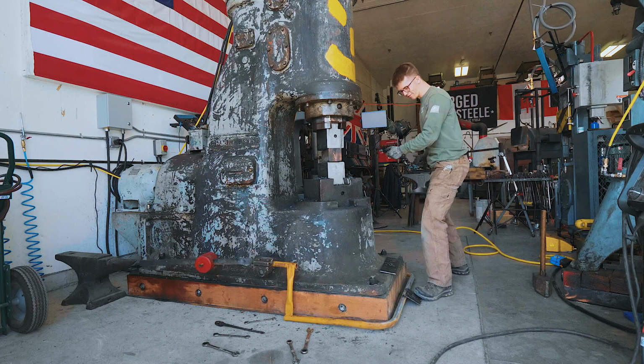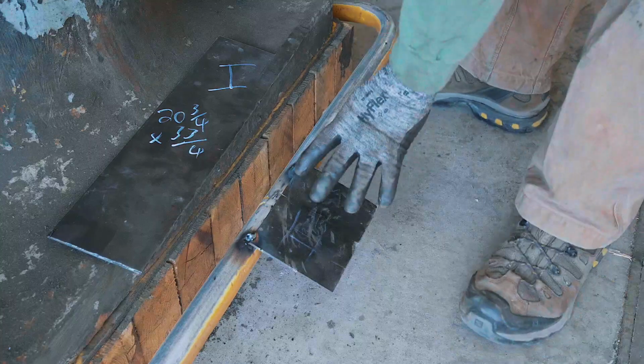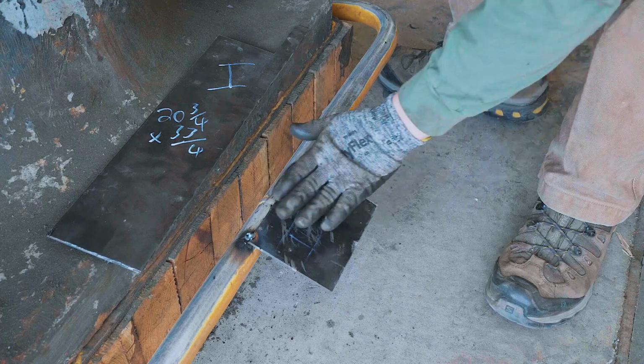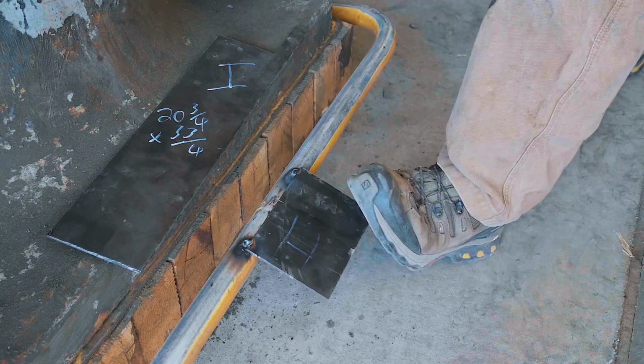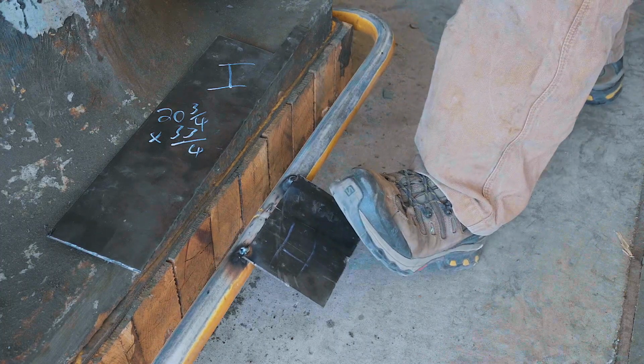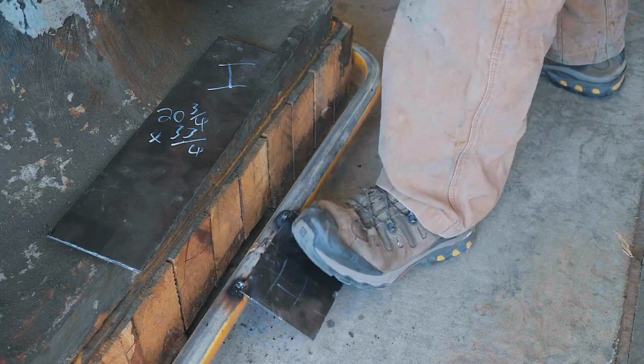That's such an improvement. Tiny change. And that feels so much better. The only real difference is instead of having the plate on the bottom angled up, it's on the top angled down. Because I want to get as close into the power hammer. So by having just one plate right there, it means my left foot can actuate that treadle real easy by grabbing on here.